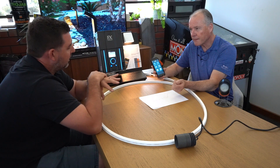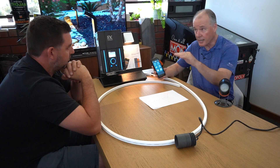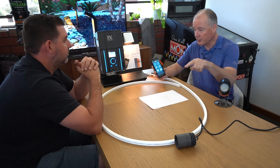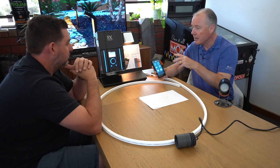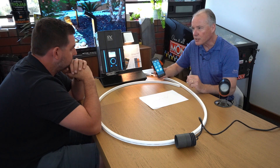Do the lights currently have any backwards communication back to the controller? Not yet — everything is forward. We send voltage down the line, starting at 15 volts; for color we want a minimum of 11, for white lights down to 10, so we allow four or five volts of drop down the line. It is always one-way communication today, but we are working on two-way for future advances.